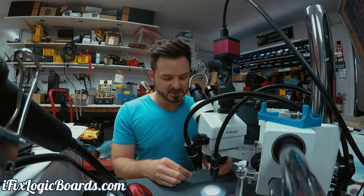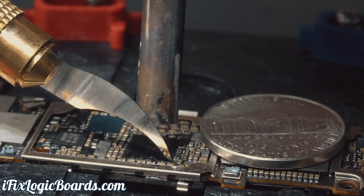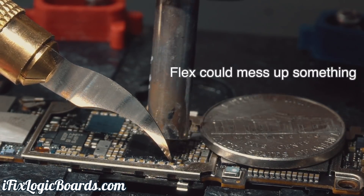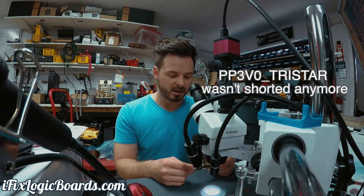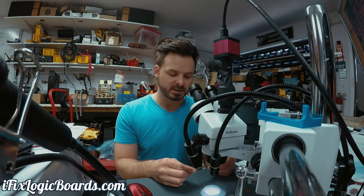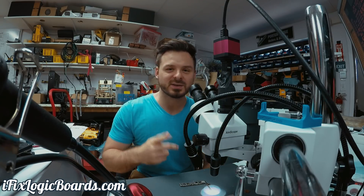Some time has passed since that recording. I did try a different PMIC, different TriStar, I looked around. And then when I was doing the editing of the video, I saw that the CPU bracket was unsoldered. So who knows — maybe there's a short on the SDRAM or the CPU itself. Although I was measuring all the CPU lines and nothing seems out of the norm. So that'll be all — this was a pretty long video. Hit that like button, subscribe to the channel, and I'll catch you later in the next video.